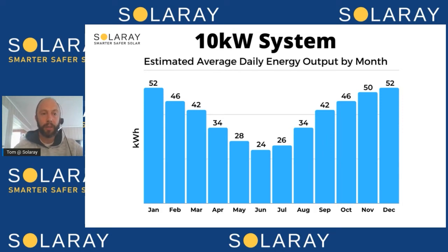What we do now — because almost everyone's going to either install a battery with their solar or will in the next few years, and we're already well above 50% doing so — is we size up the system based on your 24-hour usage. In this case with my family friend, they were about 25 kilowatt hours in winter, autumn and spring. They would use as much solar power during the day as possible, and then any excess power would go into the battery to power the home during the evening. We still use the average — which is 40 kilowatt hours a day here — but we now also look at how much you're able to use in summer as well as winter and size the system based on that.